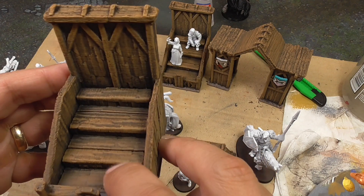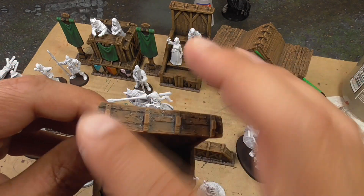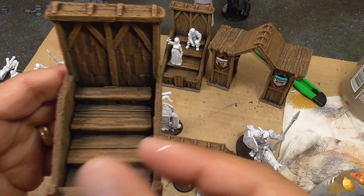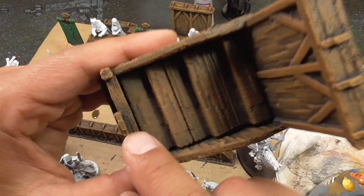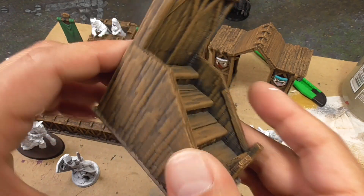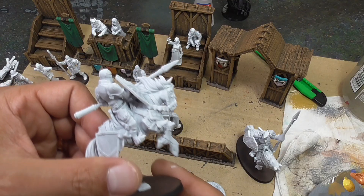Let's look at this stand. Wherever I can, the Z height is where you're going to get the most detail, whereas the flat spots at the top are where you'll see contoured layer lines. What I did with these steps is actually print them sideways, and the textures on these steps are a lot more clean than what you see at the top of the prints. The trick is to always orient your files to take advantage of the Z height for the most detail, whereas the tops are going to be more contoured.